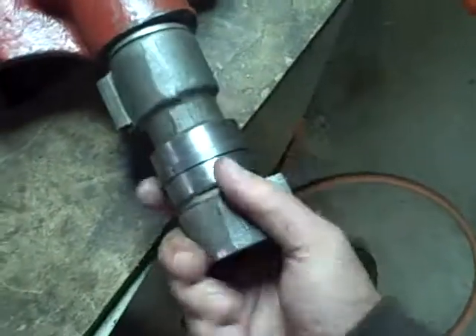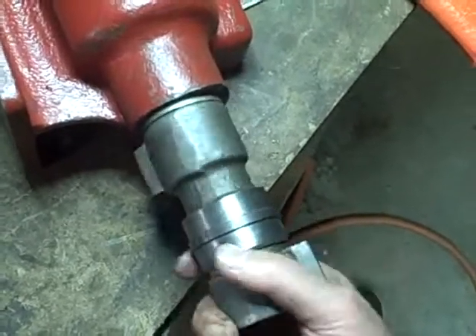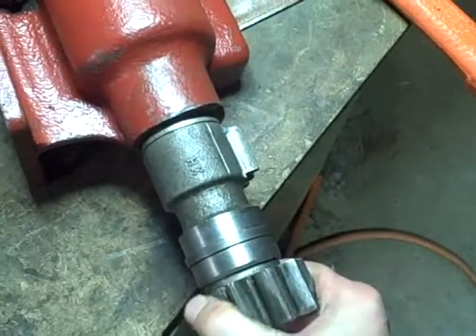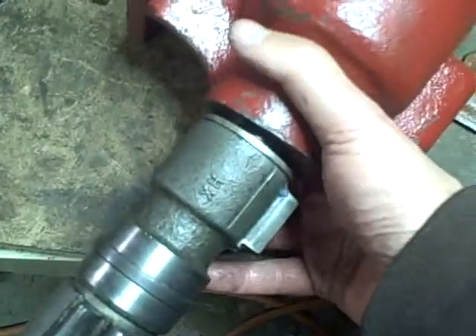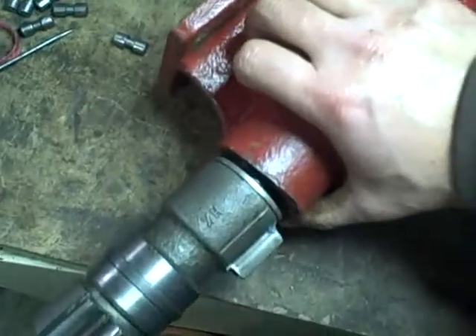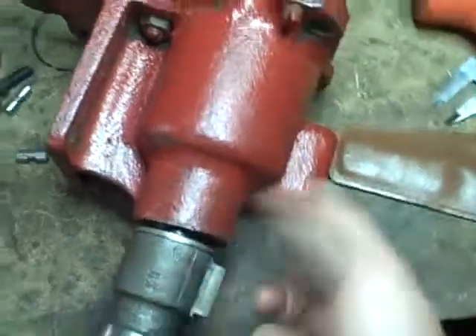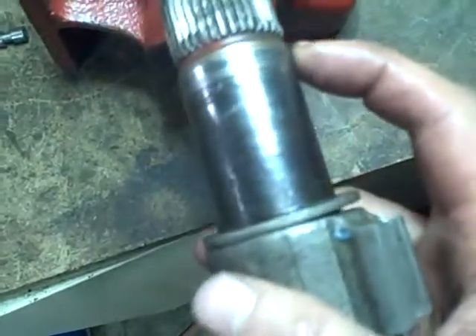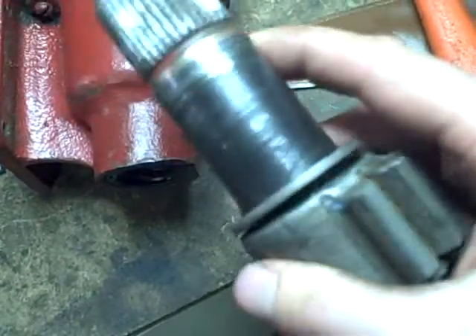I inserted this from this direction and it doesn't seem bad at all - it seems nice. If I hold this really steady and rock the shaft I can feel a little bit of play, so I don't think it's insufficient clearance there. As I pull it back out, that's when it gets really tight near this end. So I think I want to try and dress this up a little bit.